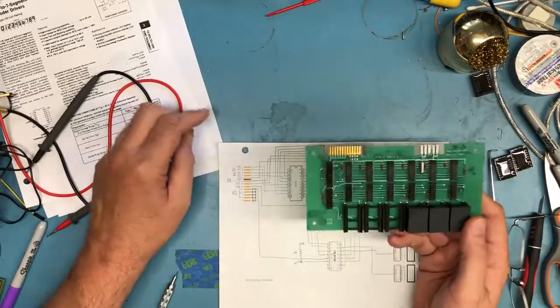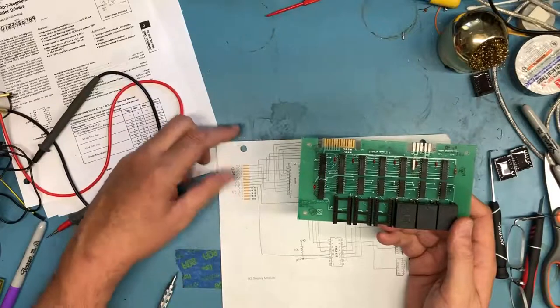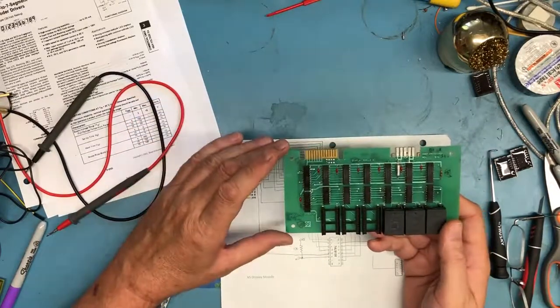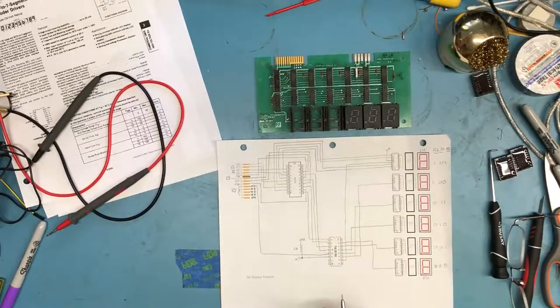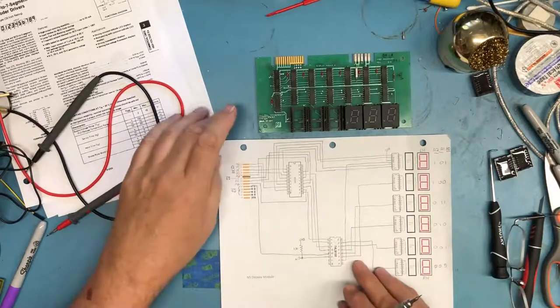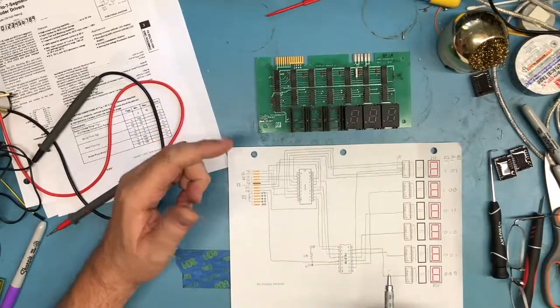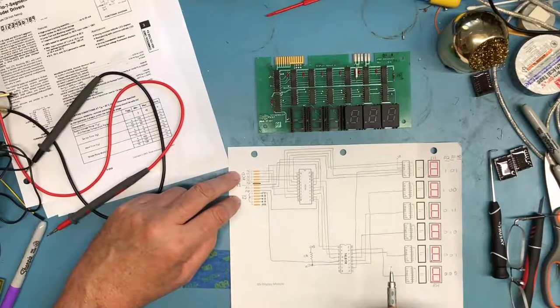To drive this, a pretty simple PIC processor would be enough, with an external RTCC module. These could be turned into clocks fairly easily. It really just becomes translating the internal representation of the clock time to the proper drive signals here.